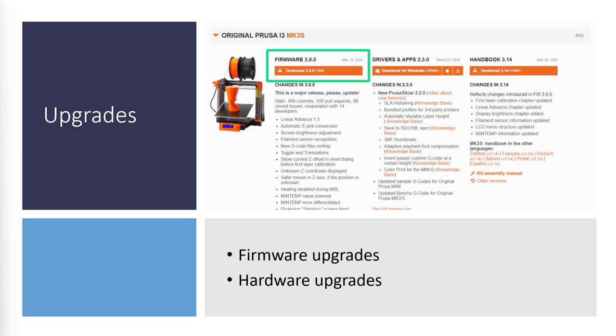As far as firmware, there are regular upgrades on a regular basis. You go to the Prusa website and look, or usually you'll get an email because you're part of a subscription, telling you it's time for an upgrade and listing the new features. Almost always I also have to change the slicer because I have new drivers, new features, and new functions in the slicer. These updates are usually once or twice a year — once a year is kind of the norm. Make sure you get all of your printers on the same firmware, because having one printer that doesn't have a menu option is frustrating, nobody will use it, and if they do they'll misuse it and it'll break easier.